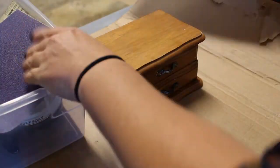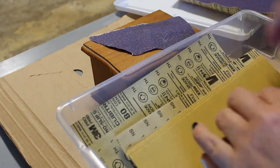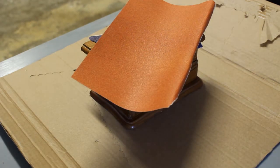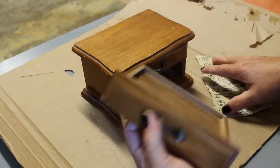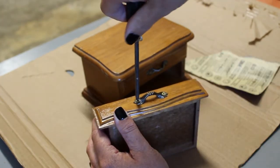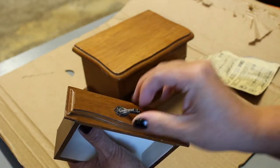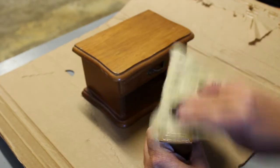Alright, let's get doing stuff. I wanted to pick some sandpaper — since I was going to rough this surface up just enough to paint it, I started off with an 80 grit and then grabbed a 120, not knowing exactly which one I would need. I started off by taking the drawer pulls off because it's going to be a pain to sand around them, so I found a small screwdriver and fought with some stripped screws a little bit but was able to get them out in the end.